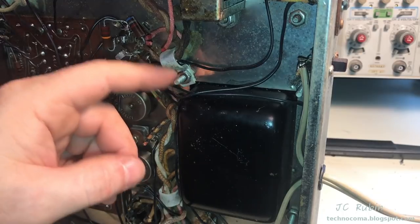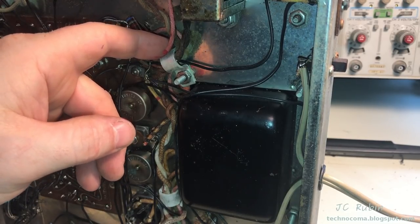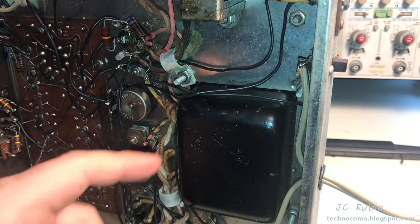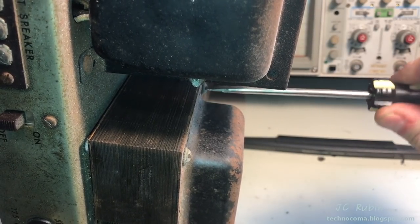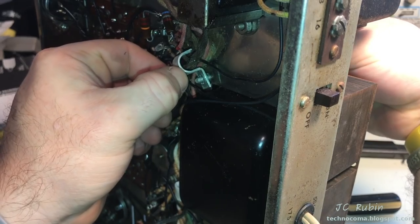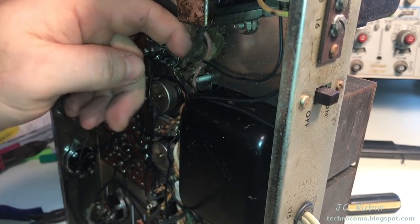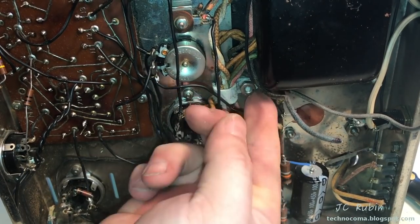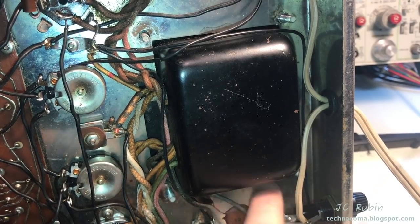Then it's rinse, wash, and repeat. Ideally, you really want to get these first, because these are the ones that are also holding the cables into place. I want to leave this one alone in the bottom as it's holding nothing. I want to get these out. These should be the priority because I want to get these cables unloomed, because as I hold this and remove it, I don't want to snag any cables and break anything. We can see now tension is released from the cables. This is important. Get this one next. And finally, the one that's holding everything in now.